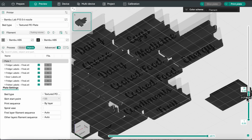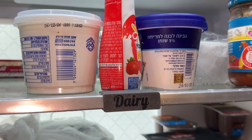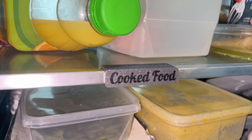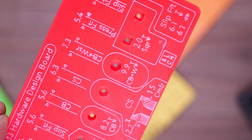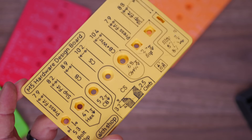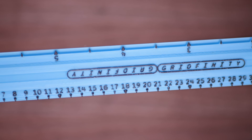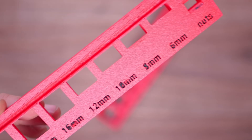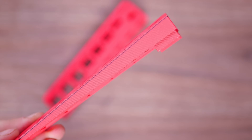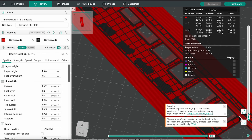In the best case scenario, you're 3D printing on the top or bottom layer, leaving you with a few options, none of them good. You can switch colors on that layer and hope the text is big and clear enough to not blend together. You can add additional layers in the same or a different color, which look better but leave you with a not-flat surface. Or you can inset the text with a color change, which becomes a magnet for dirt and debris, is harder to read, and wastes filament. Actually, all of these options waste filament because of color changes.